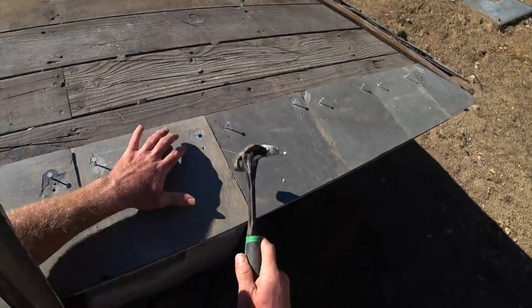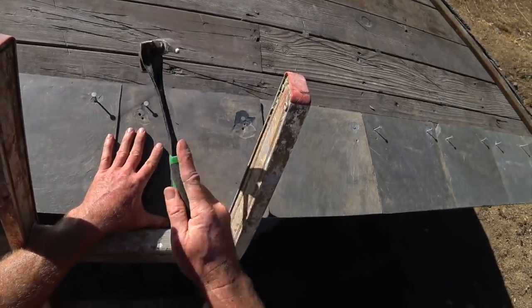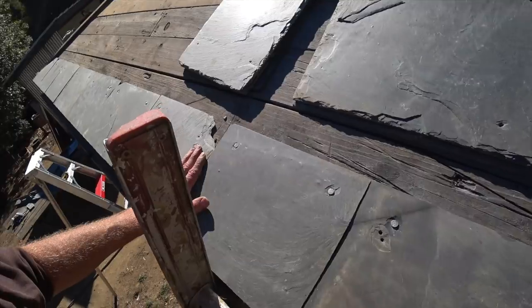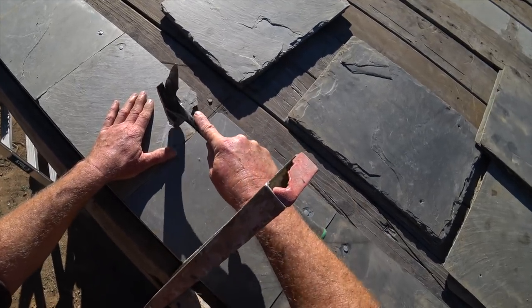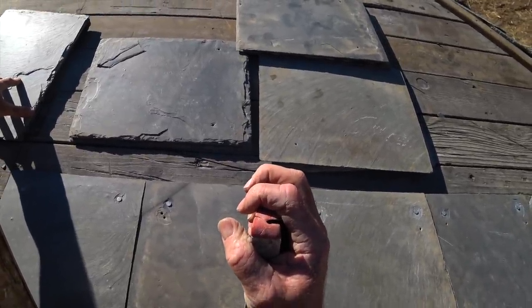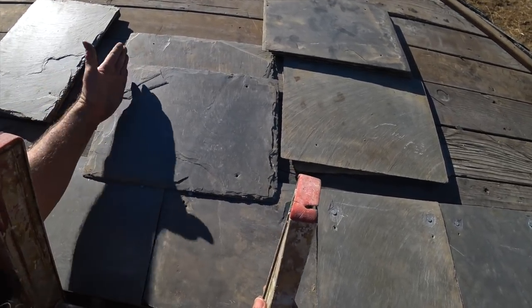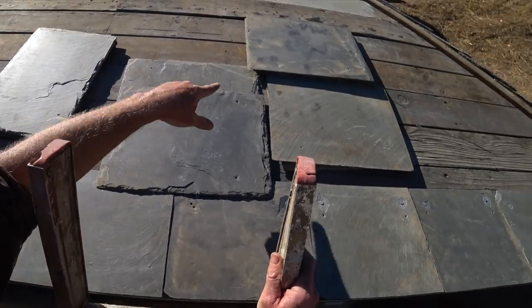You want the slates to be a little bit loose - just don't drive them tight. The first upside-down course is laid here for the base and everything looks pretty good. All the slates on the roof are the same width except at the corners, because otherwise the pattern won't maintain as you go up. This is a great example of a slate where it has a big lump but it doesn't matter because this is the face that shows, so nothing's going to be touching that.